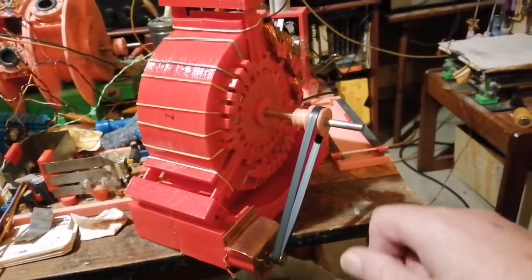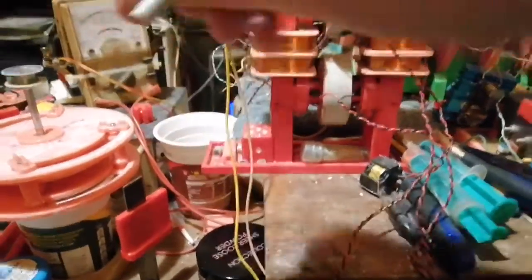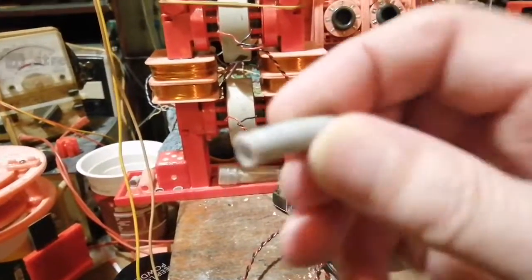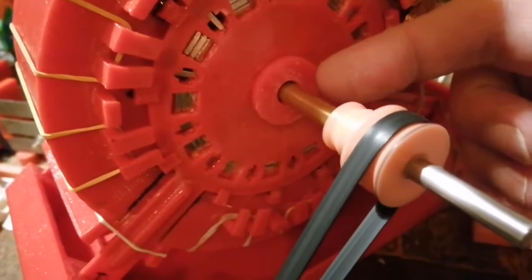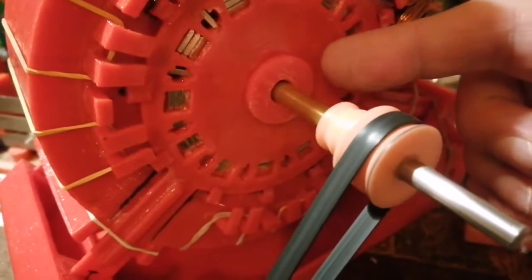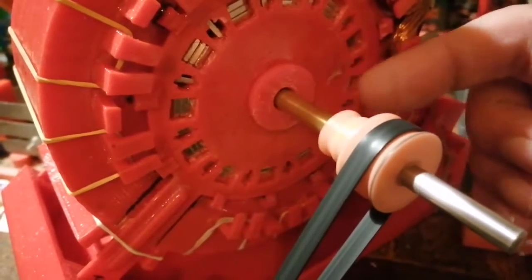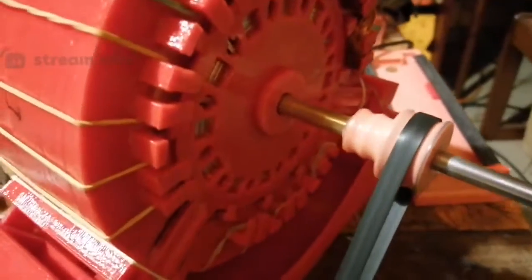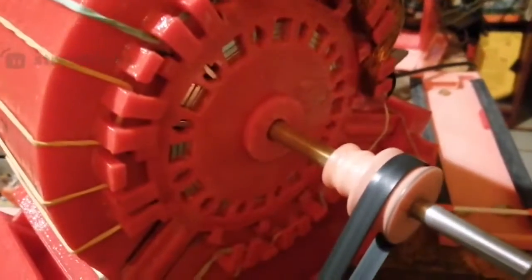But yeah, I'm actually using brass spacers now, which is somewhat better than using the plastic. These plastic spacers I was using previously, they're a bit warpy anyway. They're a bit thick, and I didn't like using plastic ones because they can catch on the walls of the bearing insert, where there's a gap between the shaft and the stator hole. Sometimes the plastic ones would catch on there, but the brass ones are a lot thinner and stronger, and they give me a much better spacing, because bits don't break off them. So yeah, but you'll notice it's very quiet.